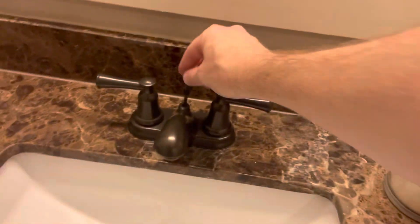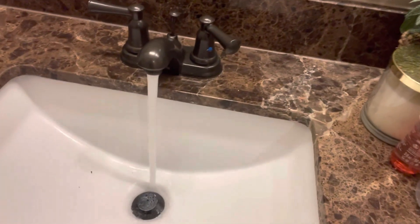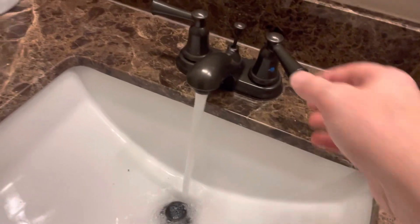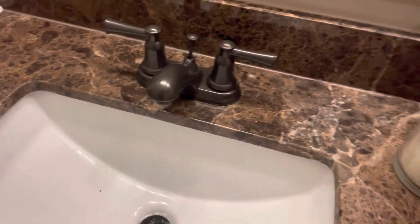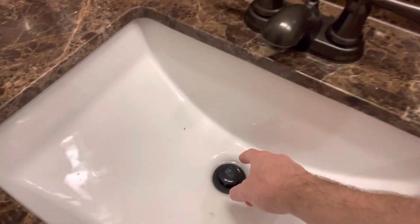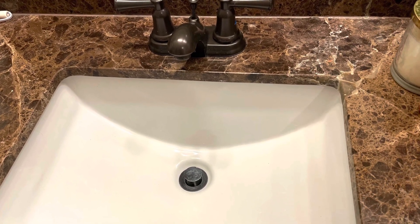Check it to make sure it opens and closes. Always make sure it's not leaking — go ahead and run some water, then check underneath for any leaking. Pretty simple, takes less than a few minutes. That's how you can clean up the pop-up stopper. Hope this helped out — subscribe if you want any more.